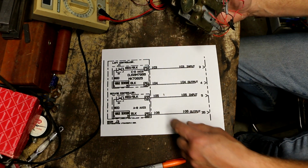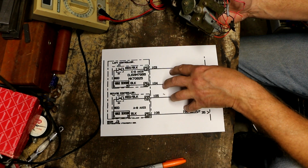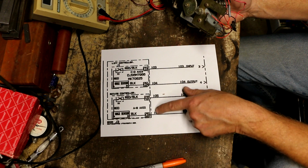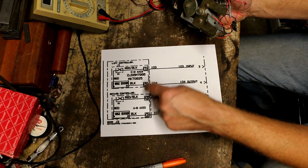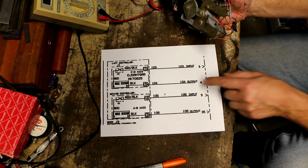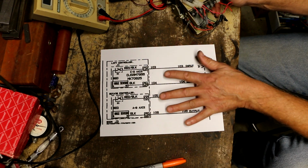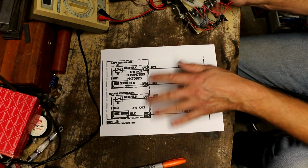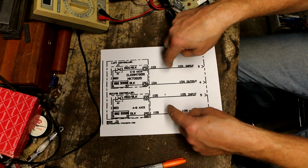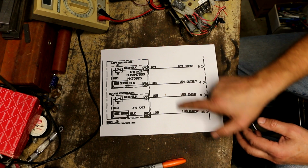There is one circuit change that I'm a little concerned about. Remember when I just disconnected these wires from these screw terminals on this thing, there were 5 wires because there was a ground wire over here. But then there were 4 wires, but 2 of these wires were tied together. So instead of having 4 independent wires going into this unit, I only have 3 independent wires with a jumper loop to create that 4th connection. If 2 of these wires end up eventually terminating in the same location, I guess it doesn't matter. But it's interesting that they don't show it that way.